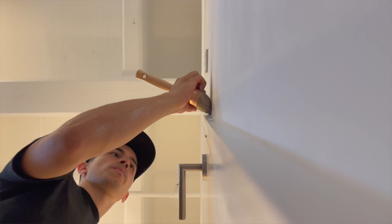Do I need to prepare my walls or prime them? You should prep your walls if you want to limewash them. For this question, I'm talking about drywall, since most of us in apartments and houses have drywall walls. On interior drywall you definitely should prep your walls, and you have two options. The first is applying a white acrylic-based primer — this is the quick and easy way to get limewash on your walls quickly, since white primer is super easy to find and relatively cheap.